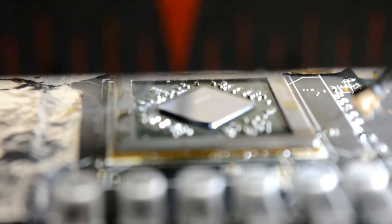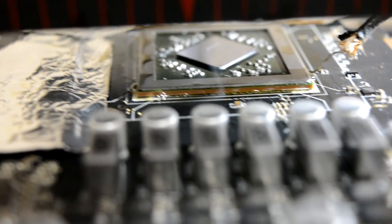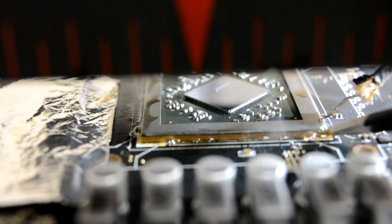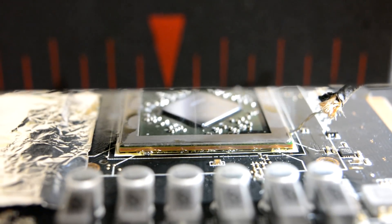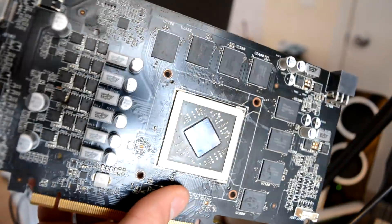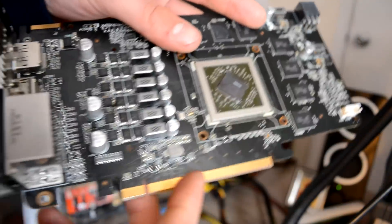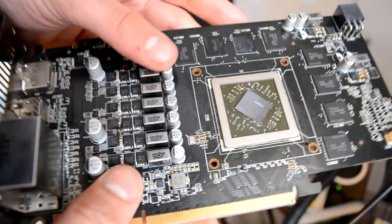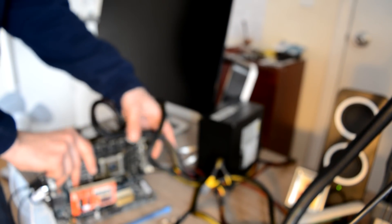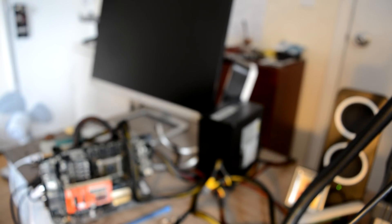The flux is bubbling — that's a good sign. It's already seated. I'll leave it for 5 to 10 seconds and it's all set. After cleaning, I checked the data pins and the power. Looks like everything is good — no shorts found. Let's put it back and test it out.